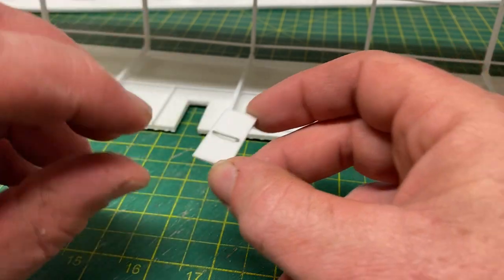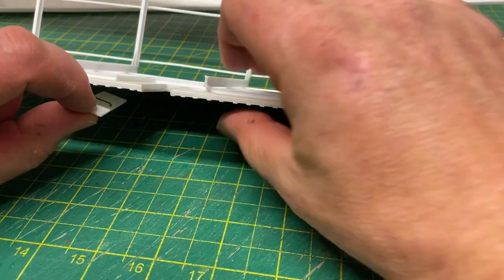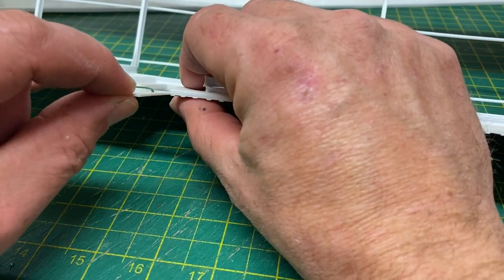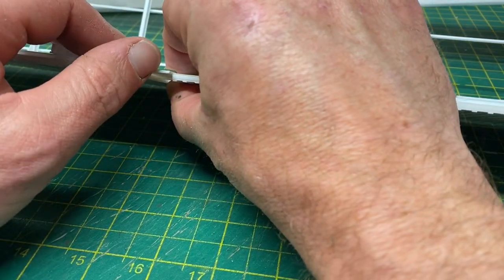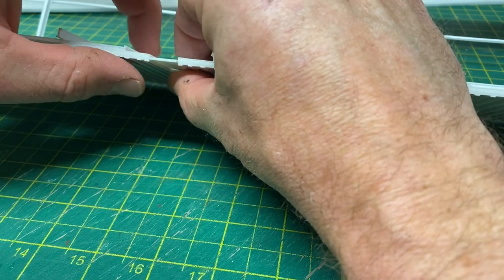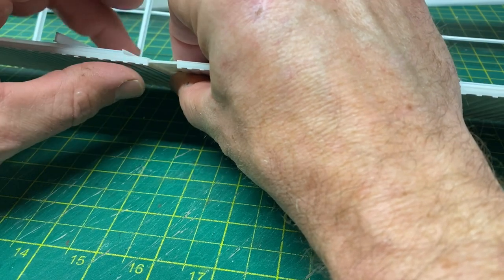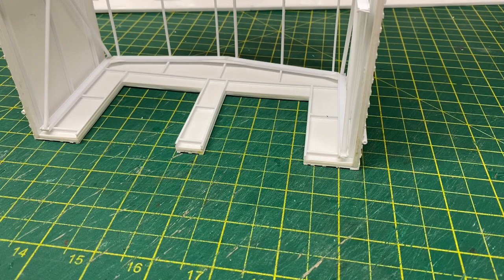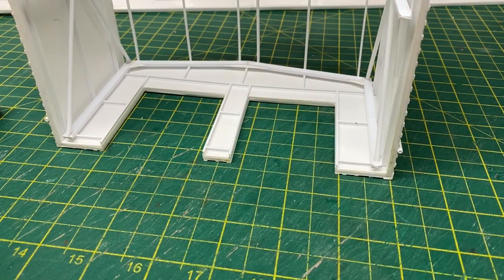So this needs glued into place, and I'm trying to put it right slap bang in the middle of the wall, reset from the back end side as well as at the front too, just to give a nice finished appearance. Just before finish, there's one other thing technically that actually still needs to be done. Still need to put a box in for the roller shutters.